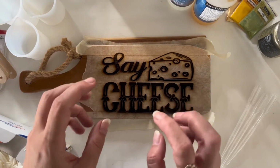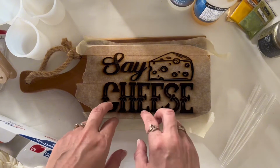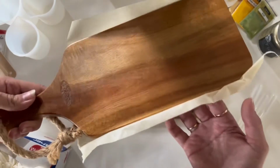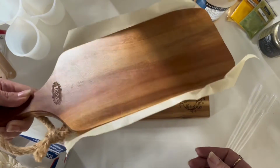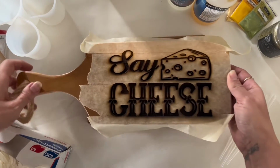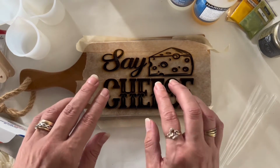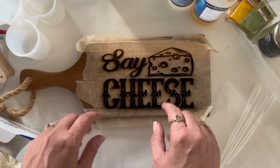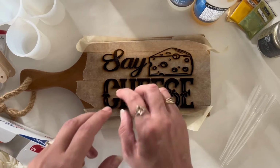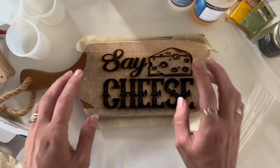Depending what type of board you engraved, you might want to seal this after you finished engraving. If you are engraving on a board that does not have this already shiny surface, or on a lighter board like bamboo and such, I recommend that you use a clear coat of some sort just to seal the edges inside the engraving.